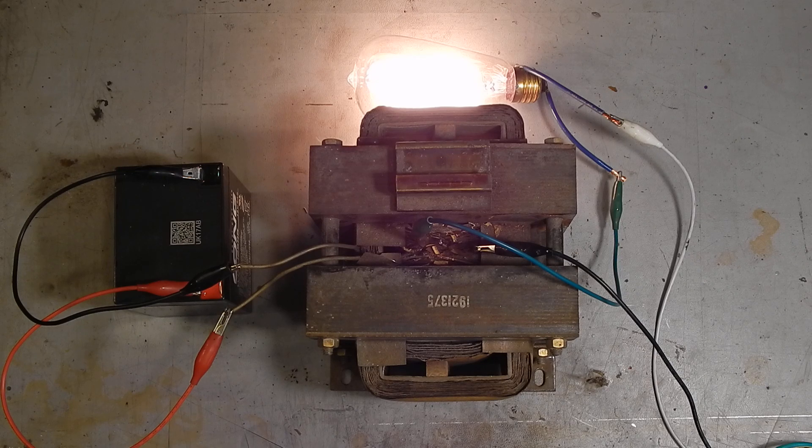So these were used in the past for current regulation mostly. This unit came out of a Bridgeport Series 2 CNC milling machine, where they were used to regulate the current for the stepper motor drivers. These were Darlington output transistors pushed pretty much to their limit, so it was very important to regulate the current — because if there was a little bit of over-current, those transistors would pop, and in fact that was a very common problem in those early Bridgeports.